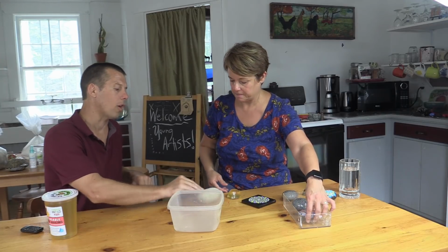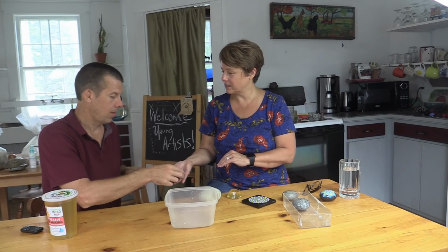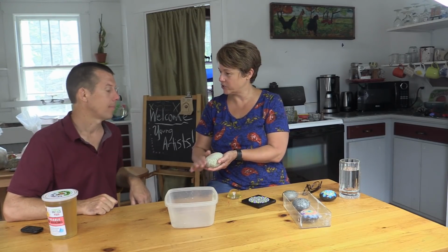Even with a rock, if you're using wood as your master, you might want to seal it first with a little shellac or some sort of varnish, and then you're good. If the original is dimensional, will that show up? Yeah, that'll show up. On plaster or concrete, you could sand that smooth if you want to replicate it, or you may want to use the cast again as a guide. The same with this one: because it has a texture, you'll get the texture, which is good depending on what you want to make.